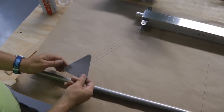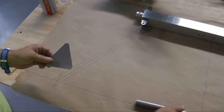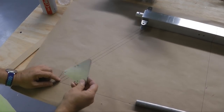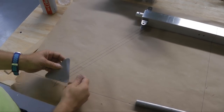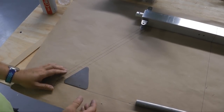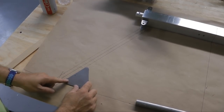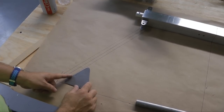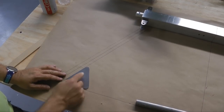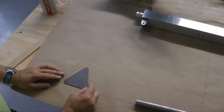So our next step is to create four of these gussets, because without them we can't really connect our tubes together. And the first step is to measure your angle here, because you don't want to just copy what's in the book if it's not accurate enough to match your work. I found it was a little bit different from the book, again, because of printing and magnification and all of that. Because what's going to happen is if you don't get the angle correct, then the tube and the edge of the gusset will wander a little bit, and then your holes will be off and maybe get too close to the edge. Because remember, we need to respect edge distance, half inch in, when we drill holes. So we want this angle to be pretty much on, and it's not a big deal.